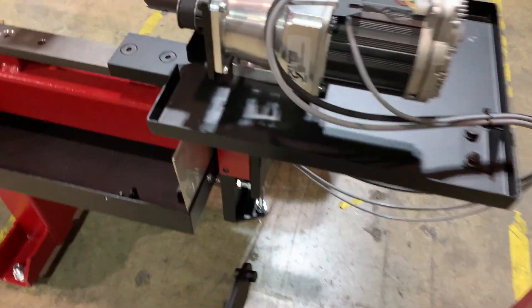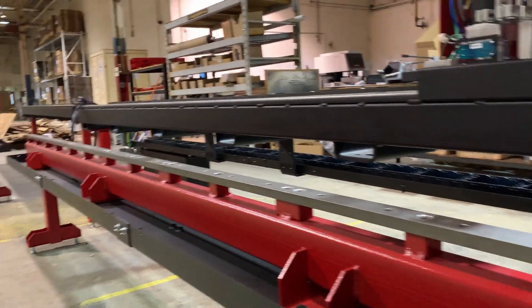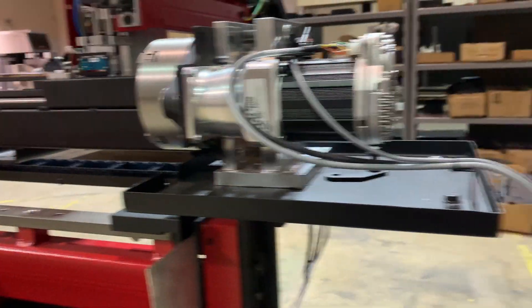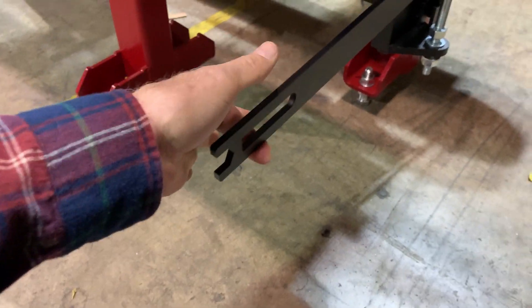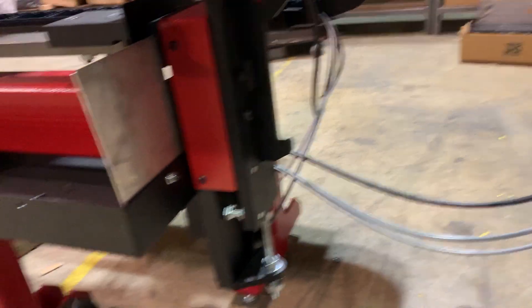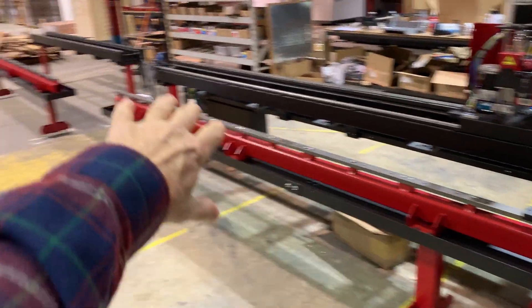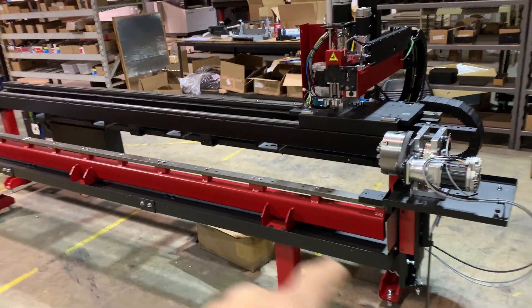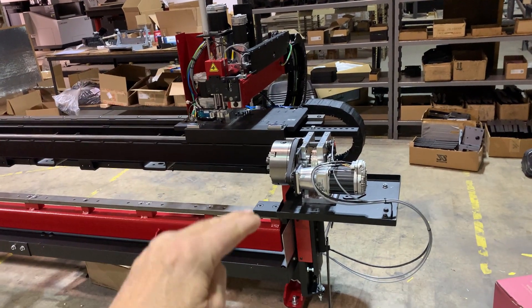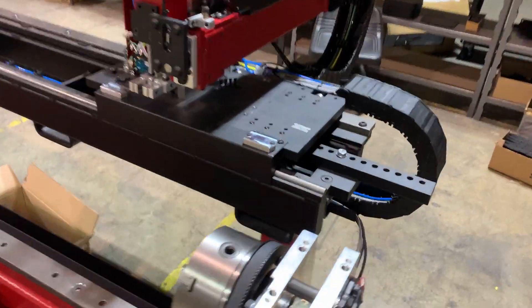That wrench I was showing you is actually for the lifter mechanism. On our machines with the tube frame, the rollers don't adjust up or down — whatever pipe you put in always lays flat on the rollers. What you do is adjust the spindle up or down. I could pull it with one finger and adjust it up or down, and when you get it where you want, you lock it down. So instead of adjusting multiple rollers all up and down for the tubing, you bolt on the roller brackets — which takes about a minute — and then adjust the head up or down to the tube. That worked out just so well.